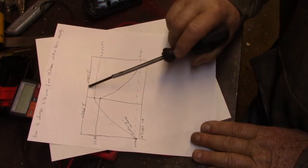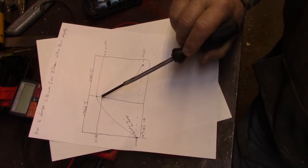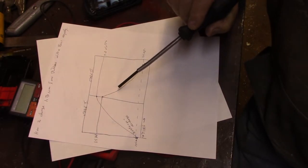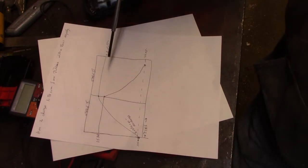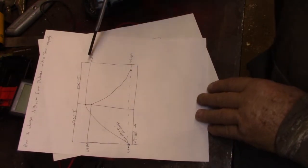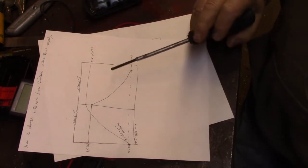I call them stage 1 and stage 2. In stage 1, you're ramping up your voltage, building up the voltage in your battery, always at 1.5 amp. But once you've achieved your top voltage, you start to ramp down the power that you put in it. The lowest you'll get is 125 milliamp. When you're down to 125 milliamp, you'll be around 4.2 volts, depending on the life expectancy, the wear and tear on the battery. If this is a new battery, you'll be able to pump 4.2 volts in it, ideally at 125 milliamp. Then you're at full charge right here. So that's how these lithium-ion batteries charge.